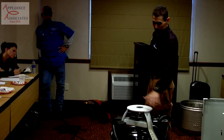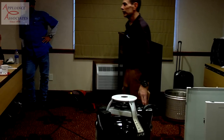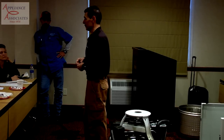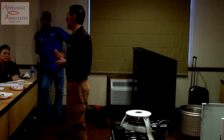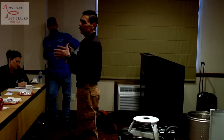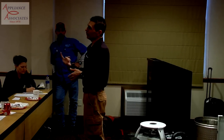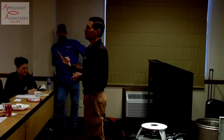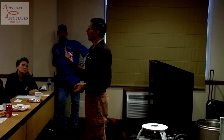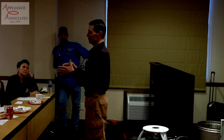Okay, so going forward here, I'll talk a little bit about the motor and a little bit about how the belt works, because it's different from our old system. Our old system had a clutching effect. When you start the machine and spin and it takes off, it slowly slips the belt around the pulley. As it gains momentum, because the pump is pumping, we start to get traction with the idler, right, that bounces against it.